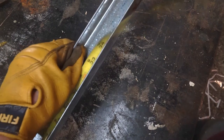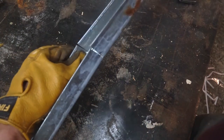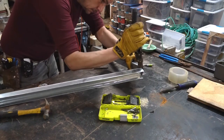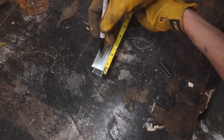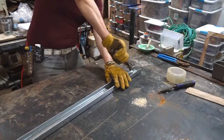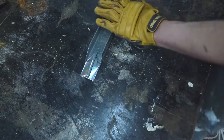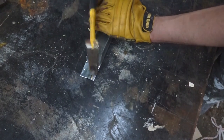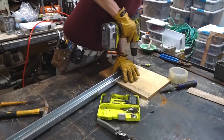I'm cutting this first piece at 33 inches. You cut these by first cutting down the sides, then bend it to get your snips in there and then down that center part. This is the 33 inch base piece. I'm marking one inch back and putting an angle — it's easy to get confused, so I suggest working with a Sharpie in this way. Then we're going to bend it down and hammer it flat. We need to drill two mounting holes in the front; I'm putting down a piece of plywood to protect my drill bit.